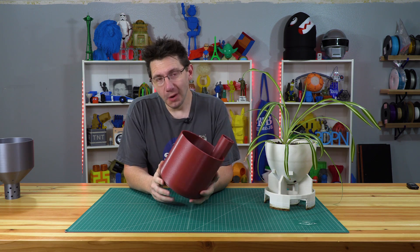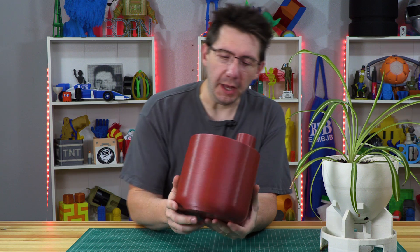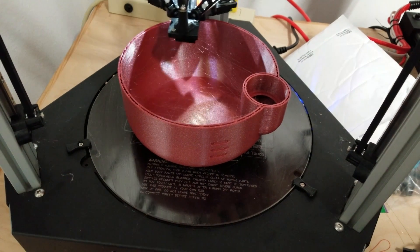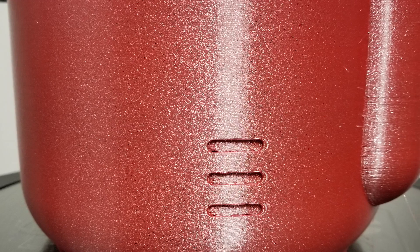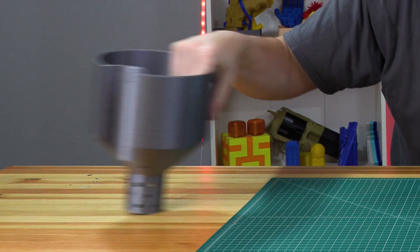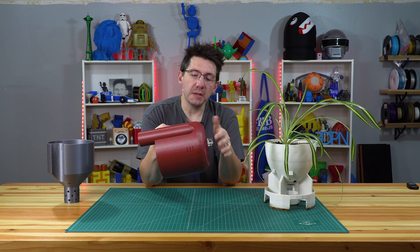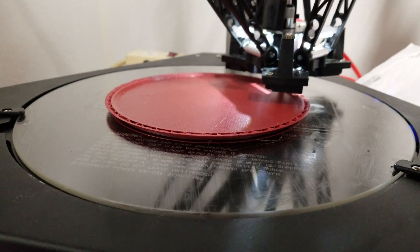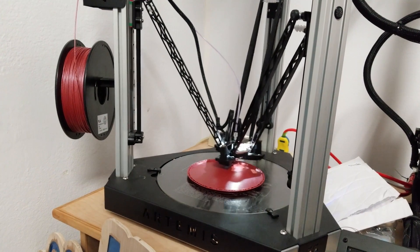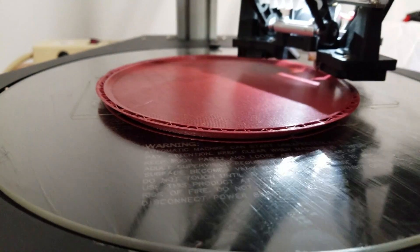This is incredible — I just want to talk about this. This is Ariana Plast. It is a red, maroony, metal-flaky something, but it's gorgeous. I'd never used this filament before. They had sent me a spool and I'd had it on the side and just never had a chance to use it, so I did, using the same settings as the other piece. The curvature on the bottom — this was sized up 200% scale — so the curvature did suffer from some heat shrinkage, which is unfortunate. The Artemis has three fans on the side that blow down and cool the area, but nothing precisely directed at the bottom of the nozzle. It's a beautiful machine, it prints really well, but you can end up with this sort of thing.